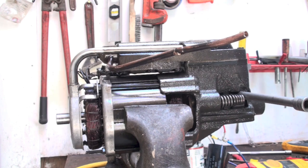See, if that compressor starts and the rotor starts to rotate, well, the windings are pushed back with the same amount of force that the rotor is pushed forward. And they were saying that this could move the windings and eventually damage the windings so that they jerk each time it starts. I thought I'd see if I could figure this out and see if there was any way I could tell that these windings are moving.